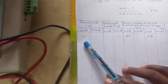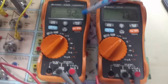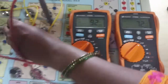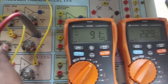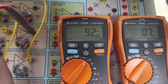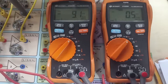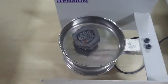For 0 kg, the instrumentation amplifier output is minus 9.1 millivolts. We adjust the zero span to the nearest value to zero. For the amplified output voltage we got 0.5 millivolts, so I have set it there. Now I have added 200 grams.